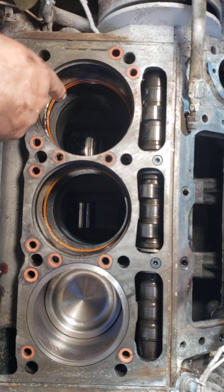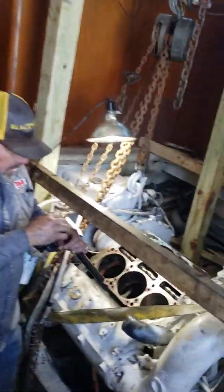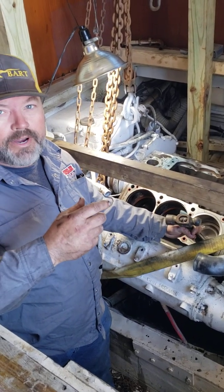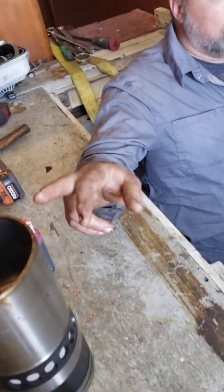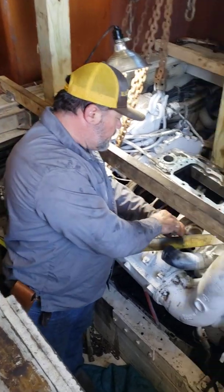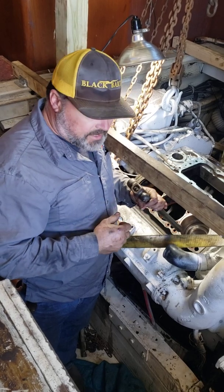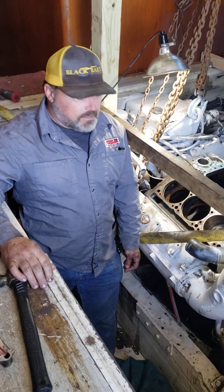We put the rod down on the crank and then somebody's going to rotate the engine over. You have to take a block of wood or a hammer and make sure that piston is following down with the rotation — if not, your rod will come off your crank and you could have damage to your liner. We broke a liner one time because the rod came off. So make sure that as somebody's rotating it down, you're up here tapping on the piston with something soft like rubber as they rotate. Then when it's all the way down and you can comfortably reach in to put the rod cap on, bolt it up.